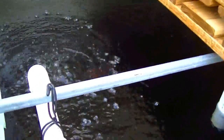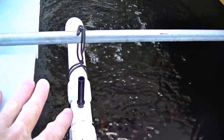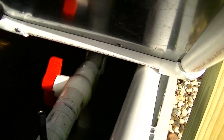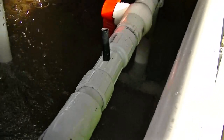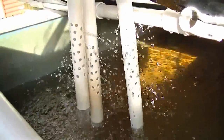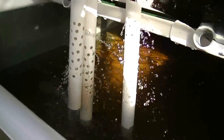More water is coming into this tank than would flow out into the grow beds, so this tank would actually overfill. In the sump tank I had a bypass valve — there's a bypass valve right there with another Venturi. That valve is completely closed right now, but if I needed to I can open it and as much water as I need will bypass right back into the sump through that Venturi and oxygenate the water. You can see all three grow beds are empty right now — all three draining at the same time.